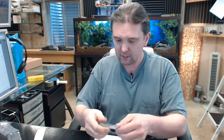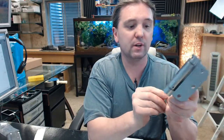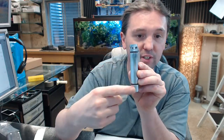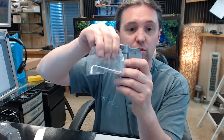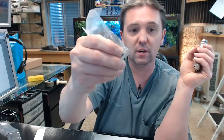So first of all, the installation is going to be accomplished with, this hinge is odd. It has two ways to set your tension. It will give you a long tension rod, as you can see here. I can poke that out of the package, and when the tension collar, you'll notice that this collar has holes and this doesn't. When the tension collar is pointed towards the top of the door, you can rotate that clockwise, and as you rotate it clockwise, new holes are revealed. It's into one of those new holes that you would insert a tension pin.